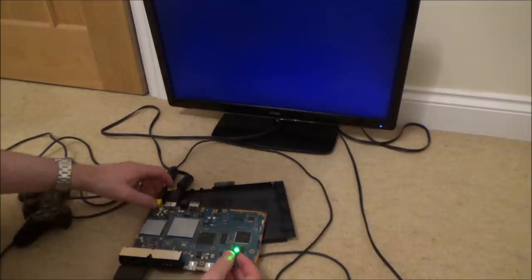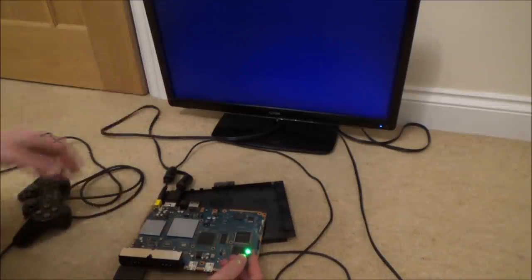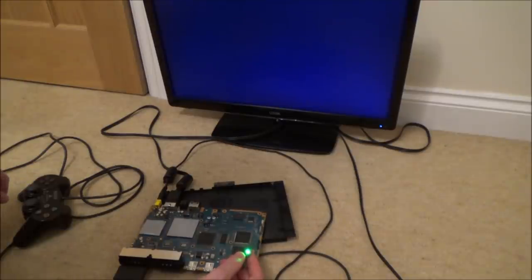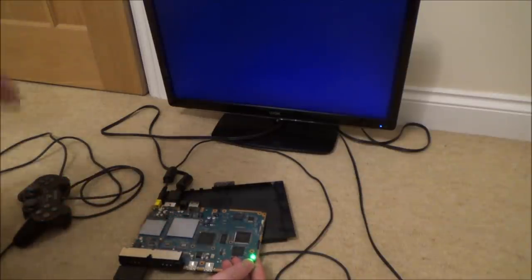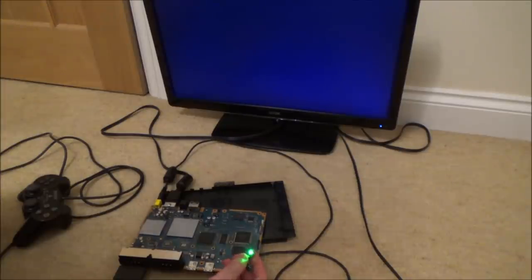So it's definitely not setting related, is it? But remember, Ash did say that even when it works, when you try to play a game, it doesn't load up the game. So again, would that suggest a voltage problem? Because when it's spinning up the disc, it's going to use extra voltage. I wonder whether the main first chip that provides the voltage in here is faulty. Maybe I should look at that next. Okay, I'm going to do more research on it.